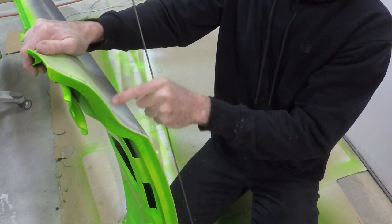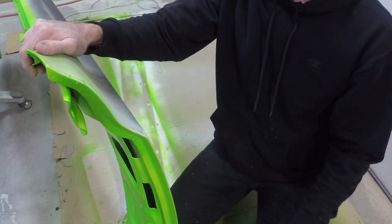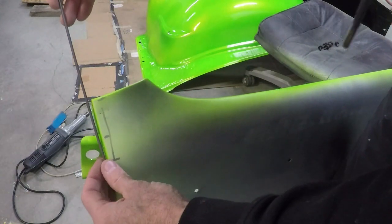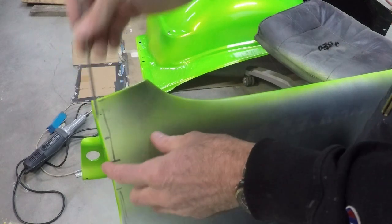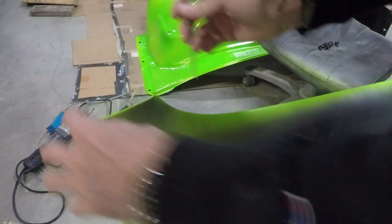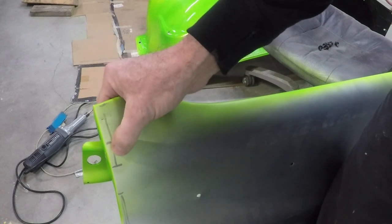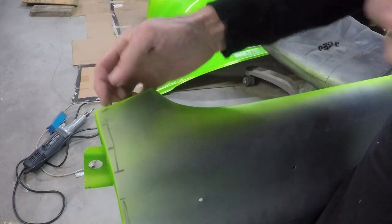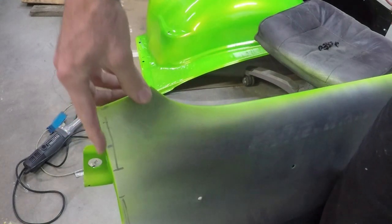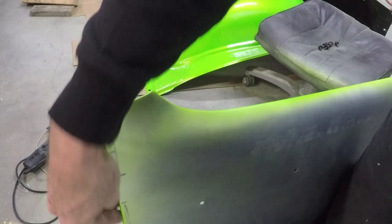I'd rather keep all the welding on one piece, because I think that door is correct. I think it's this fender that's messed up. One option that I have with this fender is instead of welding this 1/8 inch rod to the side, I could probably just split it down the side here and push it apart and then stitch weld it back up. There are 2 skins here. There's an inner and outer fender, so I have to cut all the way through and then weld it up. But that's a possibility. I might do that as opposed to welding on here, because then I'll keep that flat edge here. That might be nice. But let's go into this bottom one first and we'll see how that goes.